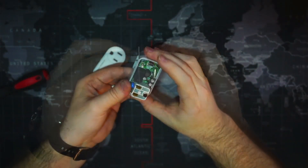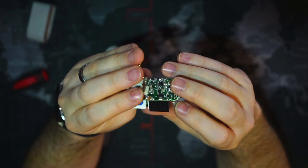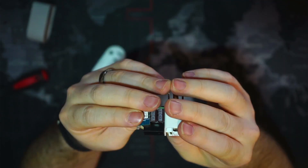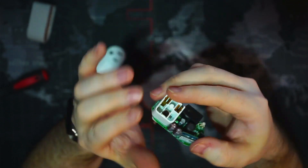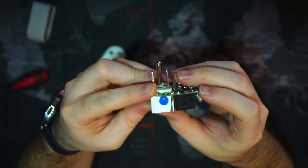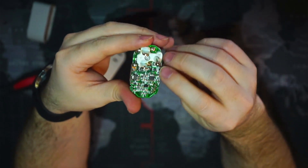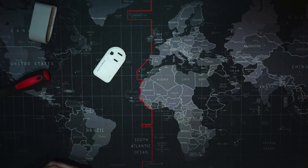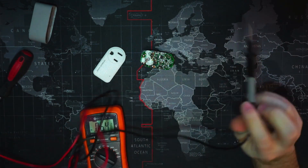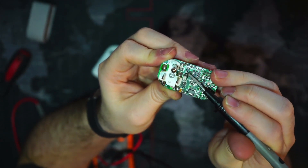Let's push these out — there's a little Wi-Fi card there, a couple of capacitors, and this is a relay — a low power to high power relay. That's what the small amount of power activates to switch on the actual plug ports via Wi-Fi. Here's our button on the side. I think we've got two fuses here — let me get the multimeter again.